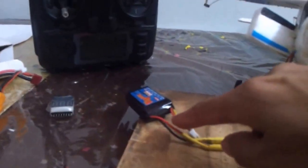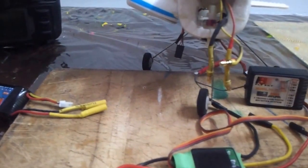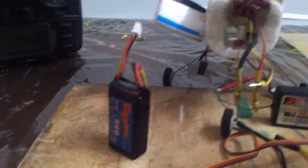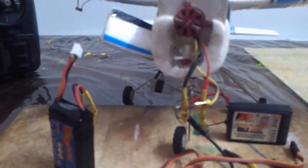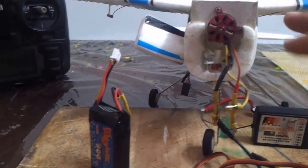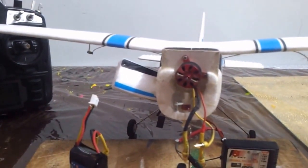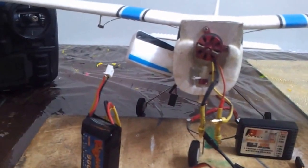These servos can only take up to 5 to 6 volts, hence they cannot receive direct voltage from the battery. In case of low voltage while flying, the power to the motor will be shut by the BEC and it will only power the servos. In that case you save the battery power for the servos, and you can use the rudder, elevator, and aileron to manage to get your plane down for a safe landing. This is what a BEC circuit does.